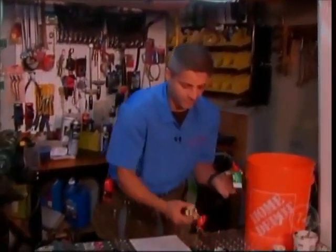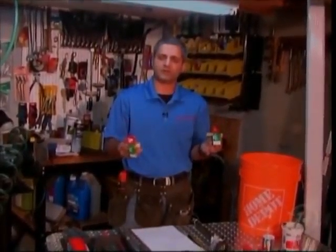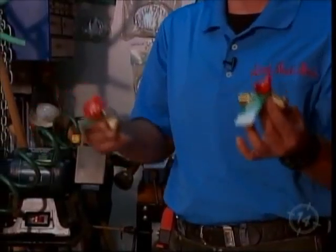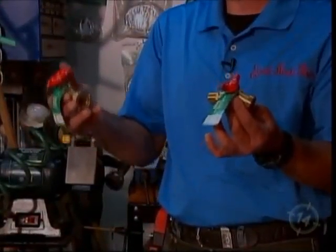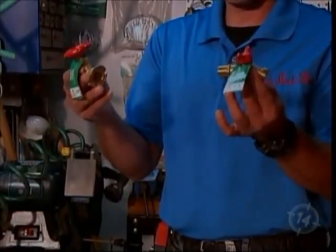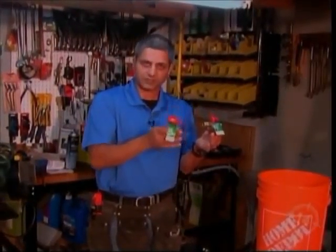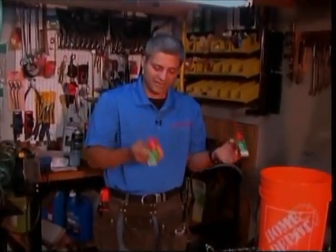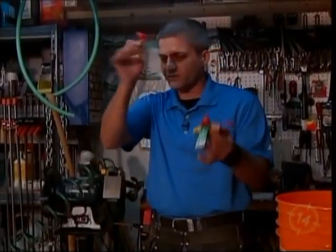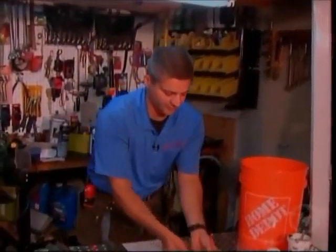Now again, with these two, you have to have a shutoff in the basement. So here's what people email me and call me about: is there a way to eliminate that leaking shutoff? Because again, with the shutoffs, they can be a gate valve or they can be a ball valve. Now, with both of these units, you've got water supply coming right to the outside of your foundation. So when the winter freeze hits, you have to get in the basement, go all around, wherever those shutoffs are, turn them off. There is a better way, and I'm going to show you.